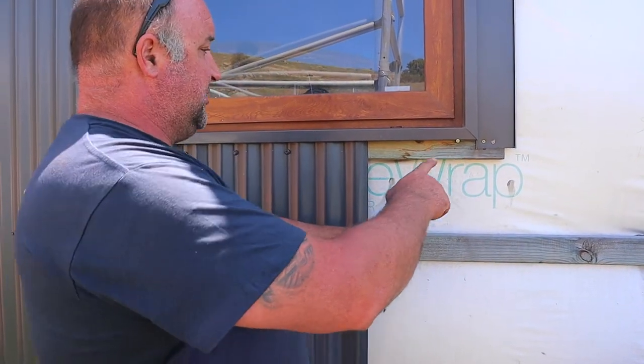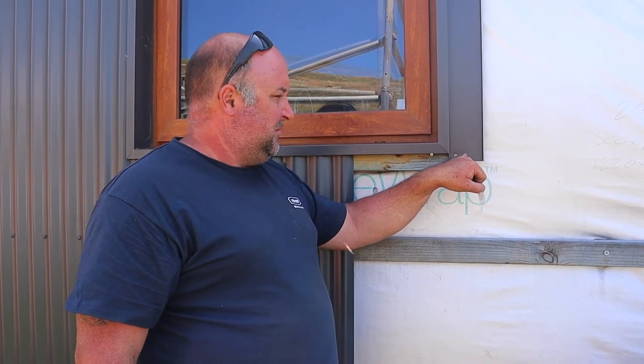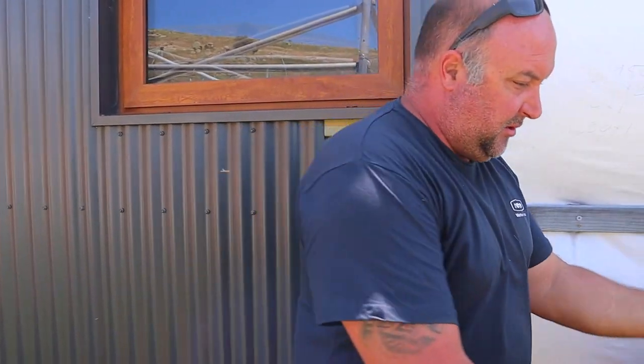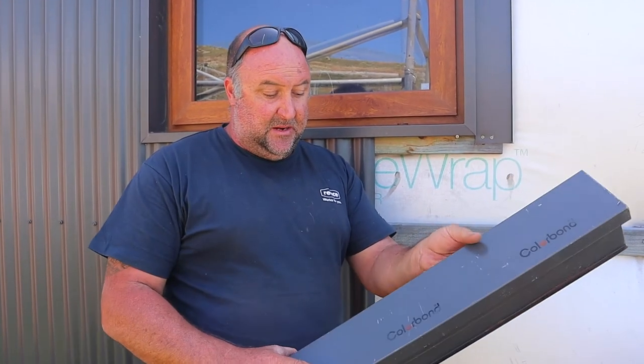So these ones are basically just temporary to hold it in location, but also act as strength as well. The flat top screws on the inside are actually hidden by the frame. So if my frame for example was a metre wide, I may be opening approximately a metre five — 1005 millimetres — just to have that little bit of play. And then I fully siliconed the whole perimeter of the inside with a pretty serious bead of silicone, and then basically just plonked the window in. It's glued in, and then we had screws that go through the window frame into our SIPS panel. And that's it.